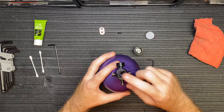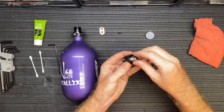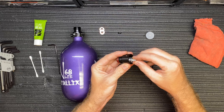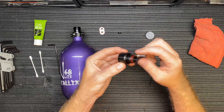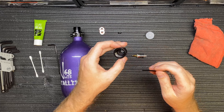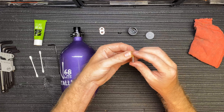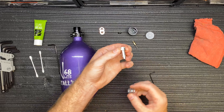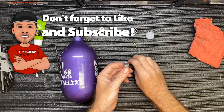The shims are everything that's going to be in the base of the regulator. On the top of the bonnet — I'm just wiggling it forward and backwards, you don't want to grab pliers or damage this area — you have your bonnet with two o-rings on it and a small o-ring on the inside. Then you have your reg pin with a pin spring, and of course your main piston and your main regulator spring.